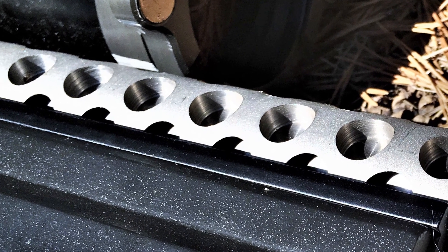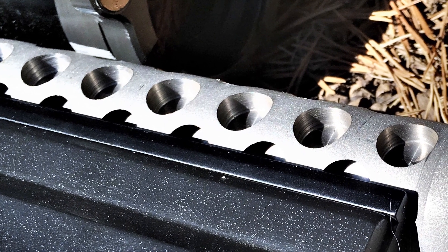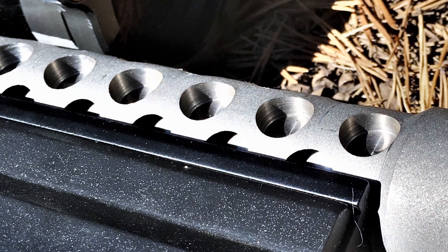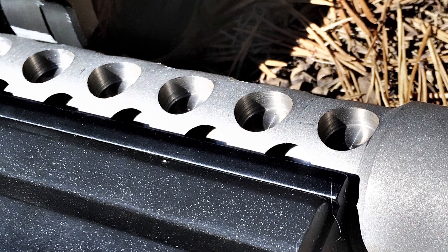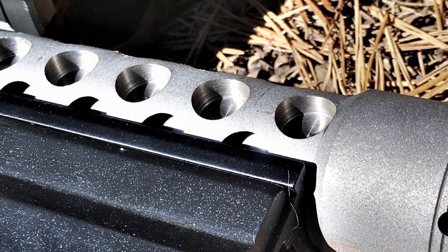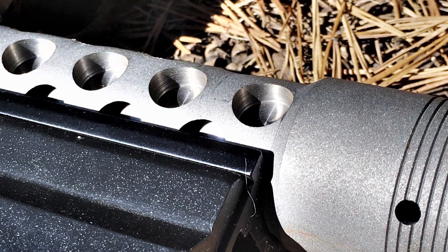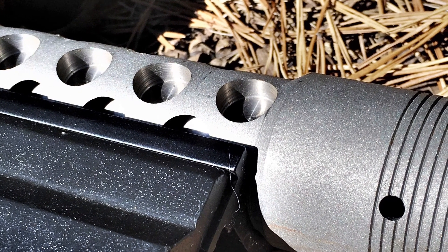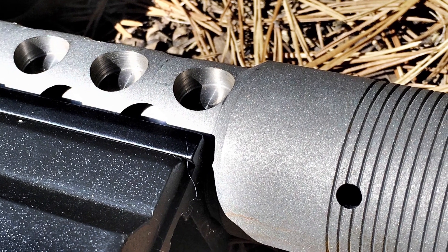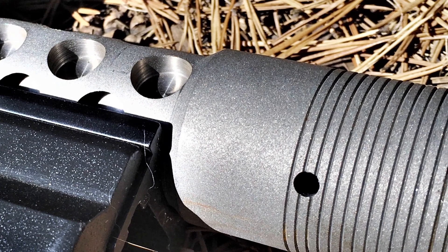This pattern here is there for maximum strength — explosive strength. We figure this large outside diameter is acting as a cage as it wants to try and pull itself apart. But the other reason is harmonics starts not at the head of the case — harmonics starts at the neck, at the junction of when that bullet first hits the rifling. That's the start of harmonics. What we've done is created a surface here that harmonics wants to start to run, then it transitions a diameter — that's a disruptor. Then I transfer into a spiral pattern — another disruptor. Then we transfer into a tube — another disruptor. And the spiral is interrupted; it's not continuous. Our falling angel pattern is just that: interrupted cuts specifically to help start reducing harmonic width.